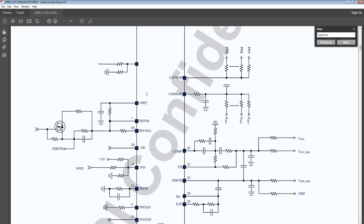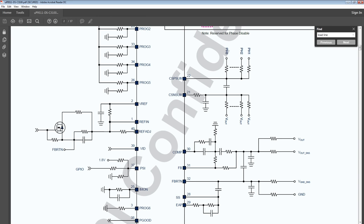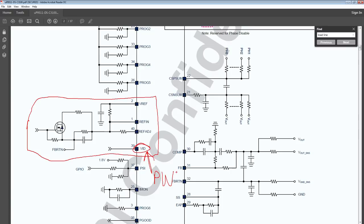This right here sets your voltage. This pin right here — you basically have a PWM signal go into that, and then that PWM signal is converted into an actual roughly DC voltage that comes out of REF ADJ. REF ADJ has a resistor connecting it to REF IN, which is also connected through a resistor to VREF.